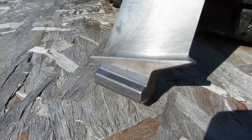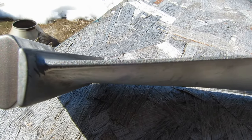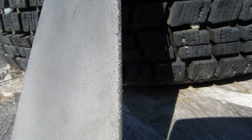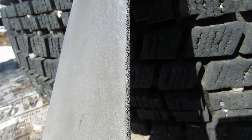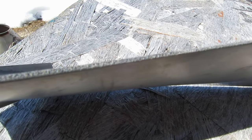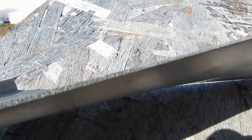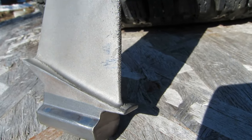There's another very good example of what happens — this can't be repaired. What can be repaired up to a limit is this: the leading edge of the compressor rotor blade. You see that rough texture with all the little pits and holes and moon-like surface — all the pockmarks from tiny particles of solid debris, sand or dust, smashing into it at very high speed. This is a solid stainless steel blade, so you can get an idea of the energy involved at 7200 to 7400 RPM. To repair this, all the damaged material would have to be filed away and repolished to a nice smooth leading edge of the airfoil. This one could be fixed, but because of the root wear we junked it. This is why intake air filtration is so important for an industrial turbine engine — they run for much longer periods of time between maintenance than an aircraft engine.